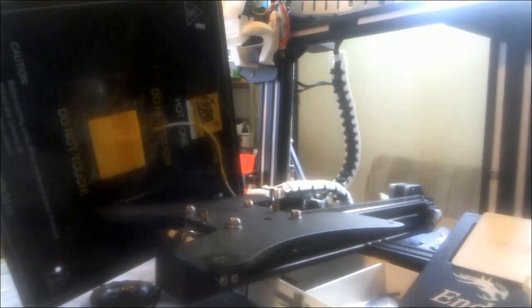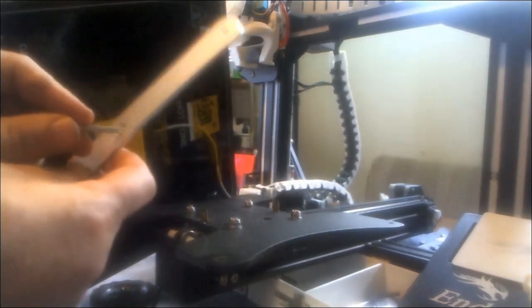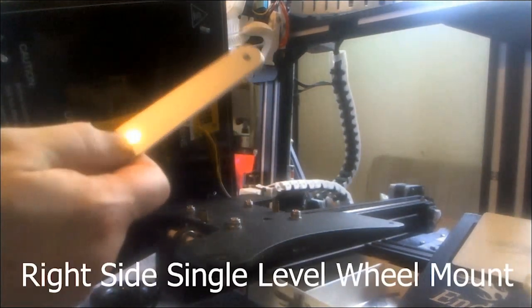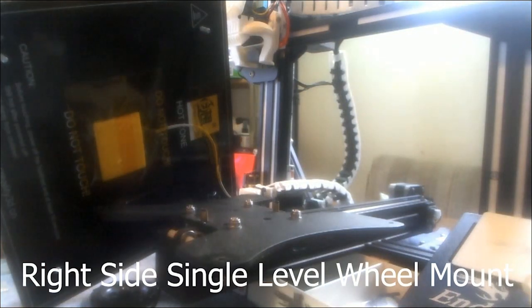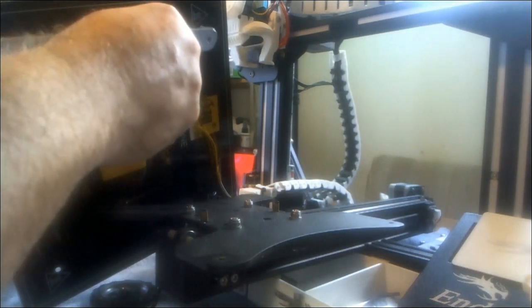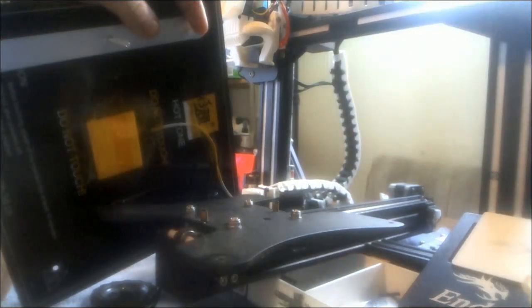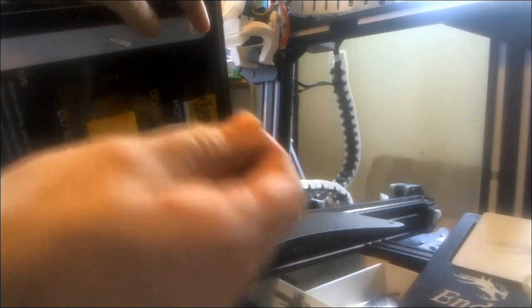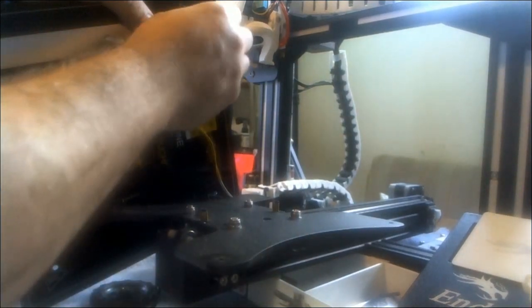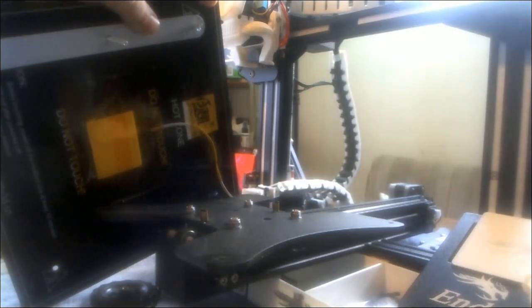This is your adapter — the machine side accepts the longer screw that comes with the screw kit. That goes flat against the hot plate. Place it over the shorter bolts and now you have that third-level screw in the center where it belongs. Lock washers are included in the kit; put those on with the M4 nuts to secure it down.